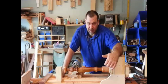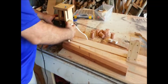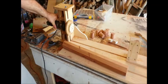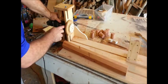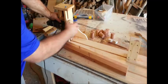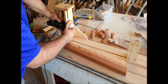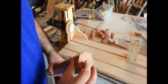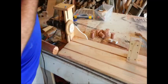The way I have this headstock made is I've got a Craftsman drill mounted in a clamping device, with an old pipe clamp holding it in. There are two bearings running through here and a 3/8 bolt that comes through. It attaches this first plate, and the secondary plate acts as my headstock. I've got a quarter-inch shaft coming out of it that pairs with this, and some screws I cut off that keep everything in place.